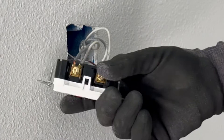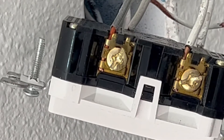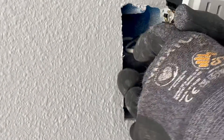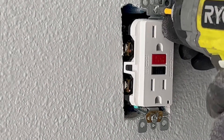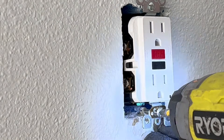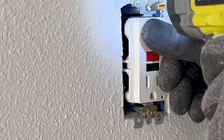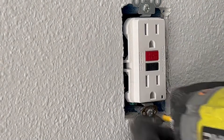Let me zoom in. Now you see very little, if any, insulation sticking above those screws — that's what we want. Ground facing down. There's a lot of wires here and they're 12-wire which is solid — just a hard wire. Try to bend these wires and then push them in, keep that ground pushed in. Kind of difficult. We're gonna come back to testing that in a minute.